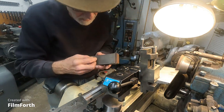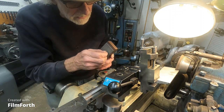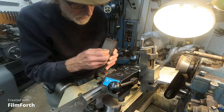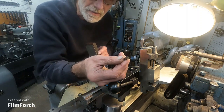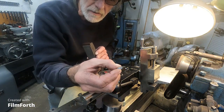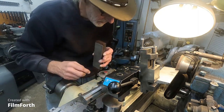The last thing I'm doing is just taking this diamond lap here and just easing the radius that I ground on the diamond wheel over. Just so gentle. Just a tiny little radius on there is what the sample had, and I got it. These used ones are sharp and just like the sample, just like that.